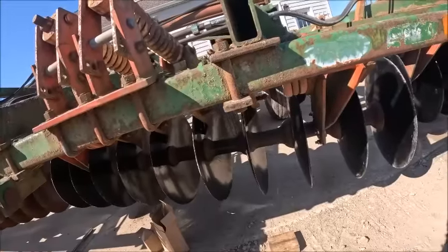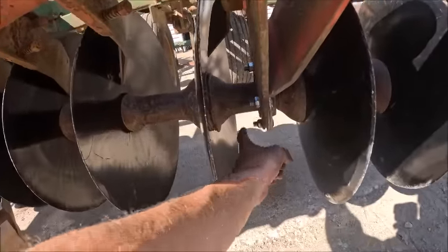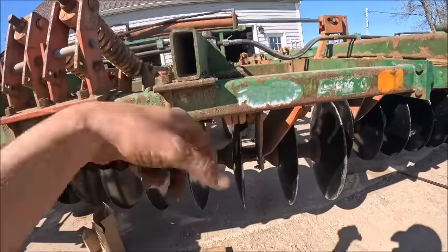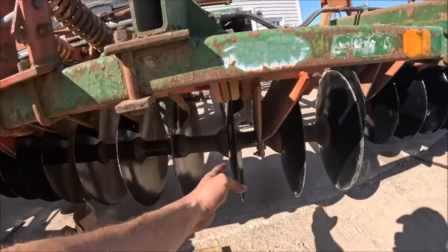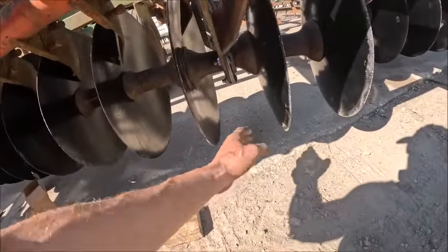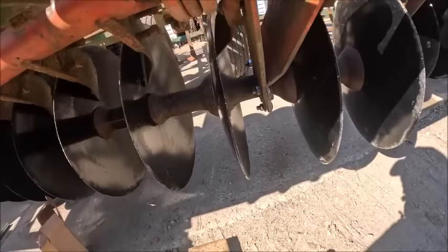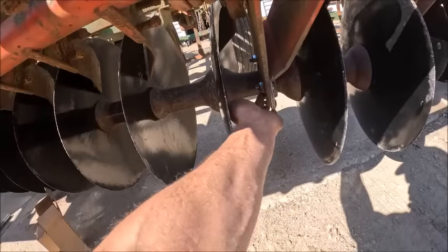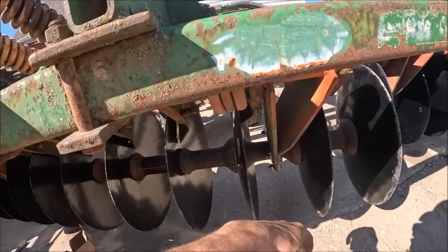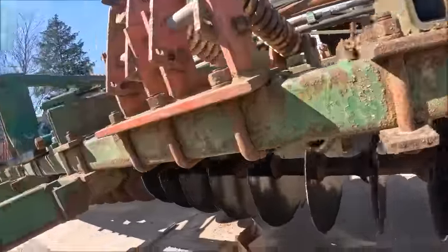I do think I'm going to end up having to buy the bearing protectors, because the bottom bolt hole on the hanger on this one and the same one on that far one, the bolt hole is basically gone. I threw a washer on there for now so I can get everything tight and where it belonged. I'll probably have to modify them a little bit to go on this side, because I think they're actually meant to go on the flange side. But if I get bearing protectors, they will solve that problem. The only other way to solve it would be to come back in here and cut it off right here and weld a piece on and hope you can get the hole in the right location. If it becomes an issue, we can do that later. But I think a bearing protector will solve the problem, so I'll just have to get some.